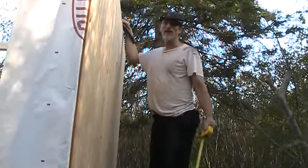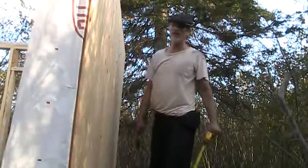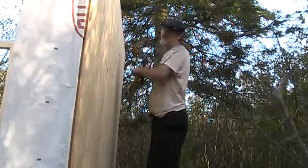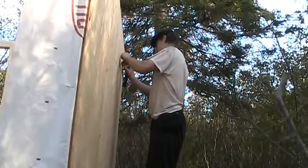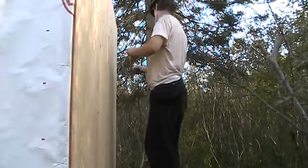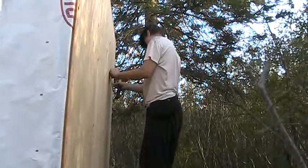I've got to find the studs and I don't have a snap line, so I'm going to be measuring to where the nails go. I'm going to nail all the way down here, then go nail all the way down there and catch the other stud. I knew where the middle was but I can't gauge the other ones as easily, so this will be tedious but we'll get there. We're winning the battle — I want to make sure there's no chance this is going to blow off.